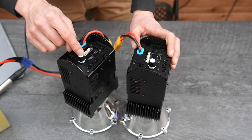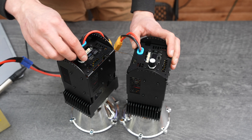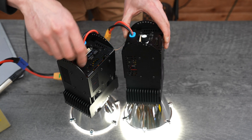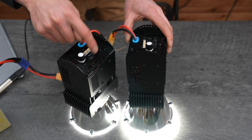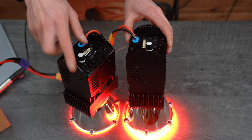This master module is in manual control mode. Going back to the main screen, go to Luminance and turn that up. Now you'll see that both LEDs are doing the same thing. The slave is being controlled by the controller board on the master module — the slave is basically just mimicking the master.